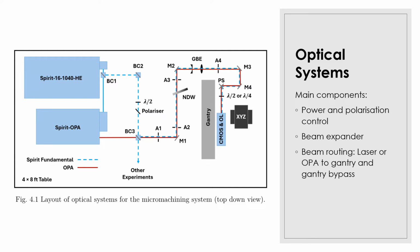So this is just the written version of what I just said, and of course the XYZ stages is the stack up of Aerotech stages. The stage we actually use for this work is the ALS 130 stage, and in theory these stages have a minimum incremental motion of 1 nanometer, but in reality we're typically stepping on the order of about 1 micron. So if we can hold a precision to around 10 nanometers, that's well within the capabilities of these stages.